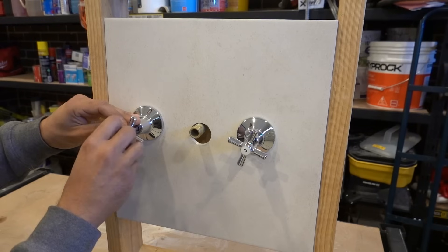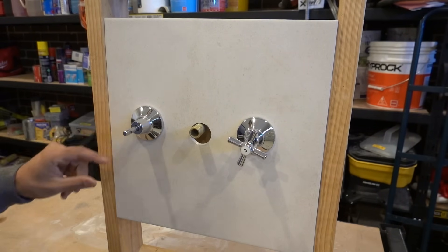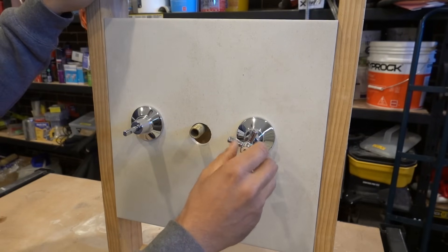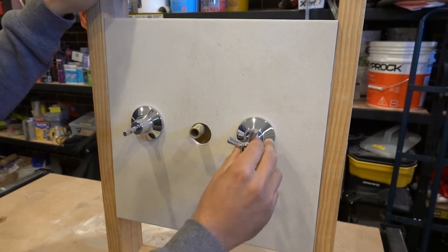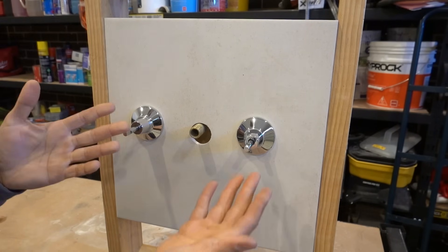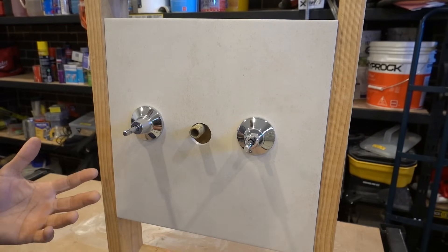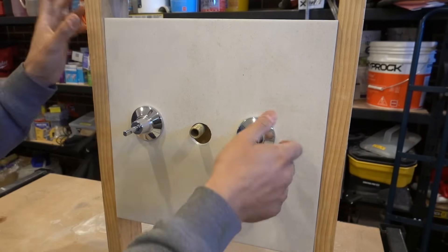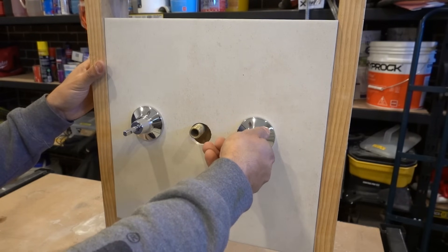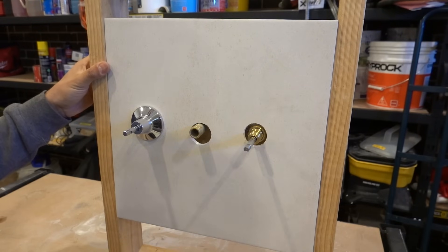Take off the hot one and remove the handle, then do the same thing on the other side and remove that handle too. Sometimes if they're very old taps you might have to wiggle those handles around because they might have a bit of gunk built up. Next, remove the outer covers — these ones simply unscrew. Lefty loosey righty tighty: turn to the left and that'll unthread just like that.